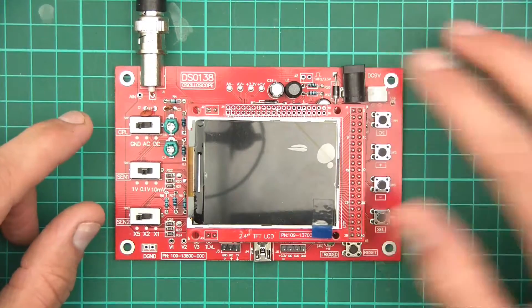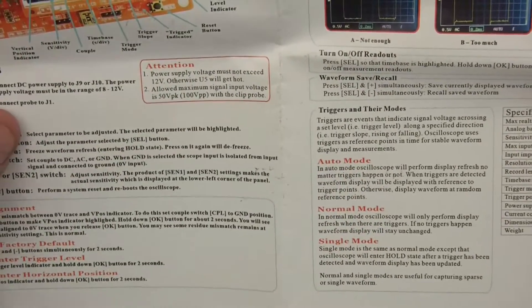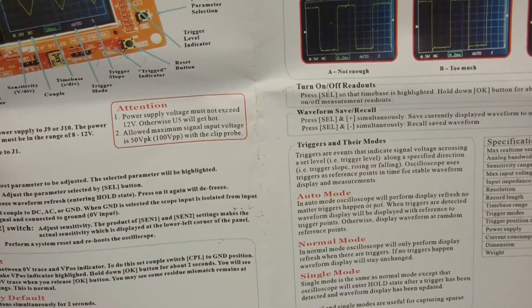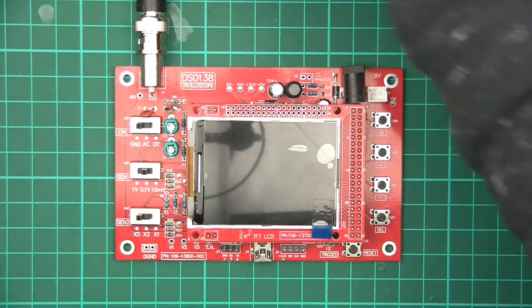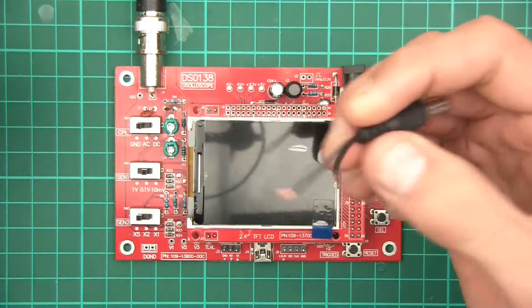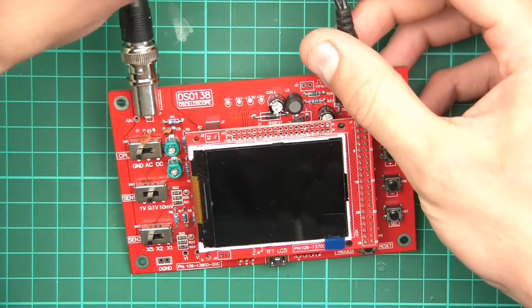I've noticed that you need a 9 volt power supply and I haven't got a 9 volt one — I've just had a look at the specs to see if I can get around this. It says it must be between 8 to 12 volts, and the power supply must not exceed 12 volts. A 12 volt charger will usually be above 12 volts in order to charge, so I can't use that. But I've found this cable — must be something I cut off a while ago — so I'll plug that in and use my bench power supply set to 9 volts.